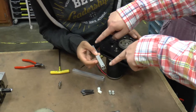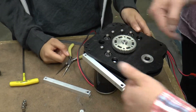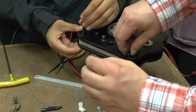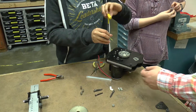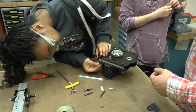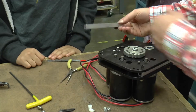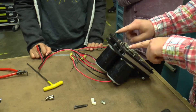The screws up here clamp together the top end of the gearbox through these holes. Put the spacer in here, don't drop it, get it lined up with this hole, then put the screw through the same way and thread the nut on the back. What's the next step? I think we'll tighten all the structural fasteners here first, then do the motors. Tightening the structural fasteners first will bring the gearbox into better alignment before we tighten the motors. Tighten them up until it just starts to feel stiff — I don't want you to crush it, because you have the power to crush this plastic gearbox.